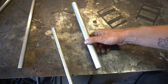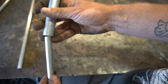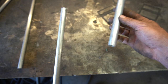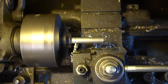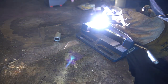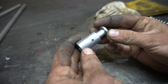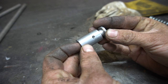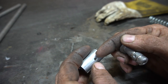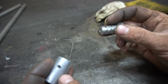Now we need to start working on the actual dispenser mechanism. I'm taking a shaft that will ride up and down inside of a collar. The inner shaft will be a cup facing up towards the acetone, and each of them will have a hole that will line up when it's put into the right position. The game plan is starting to make more sense: O-ring here, O-ring here. When this plunger is pushed up, these two holes will align and the fluid can pass through. The problem is, in its resting position, the top O-ring is beneath this hole and fluid will get through anyway — so we need a longer shaft with another O-ring for this to actually work.